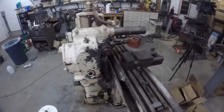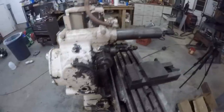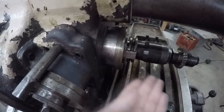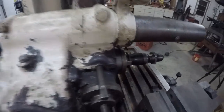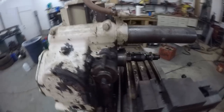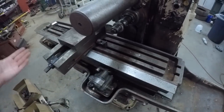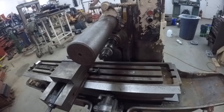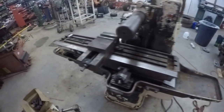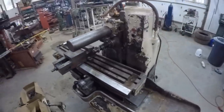When I got this thing I thought a use for it would eventually materialize, but it kind of hasn't. The problem is it can't really do the same things a normal milling machine can do - you can't cut on the Z axis because there isn't a tapered gib in either of the ways to keep them snug. You can cut a little on the Y axis by moving the spindle in and out but you only have an inch and three quarters of travel and it's clumsy. And while you can cut along the X axis, there isn't really a provision to stop the table in an exact spot. So while it's a really cool piece of machinery, I just don't have enough use for it to justify the floor space. I'm going to try to sell it.